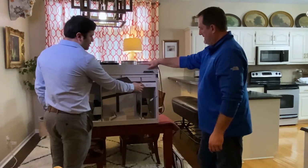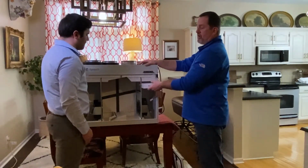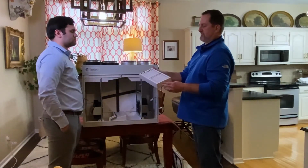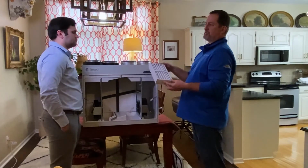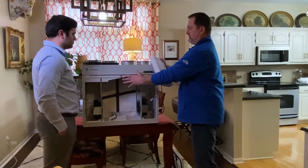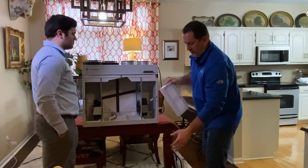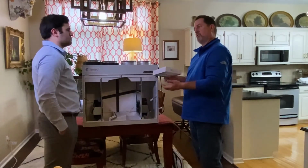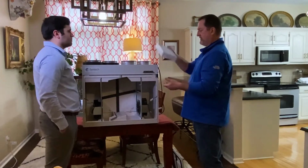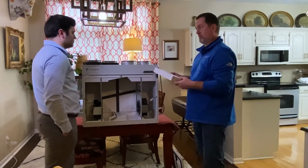And is this something that I need to take notice of? Sure is. I'm glad you noticed. This is one additional filter. Now, not all of our different models have this. The Hero series in particular has this final filter, we call it. And this filter is one more air cleaning measure that this unit will have for that fresh air that comes from the outside. So as the fresh air comes in, we're running through the core to recover energy, but then we want to clean any additional dust that might be in that air with this final filter. So that air comes through this final filter before it's delivered to your home.